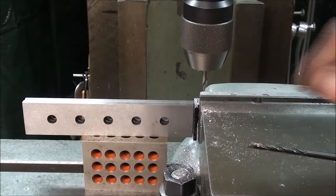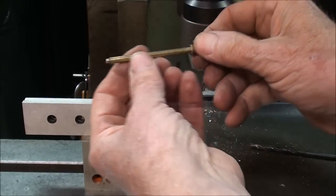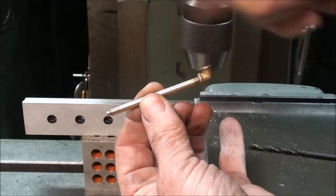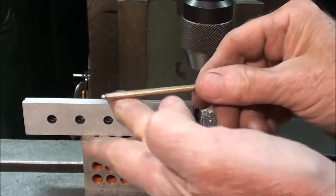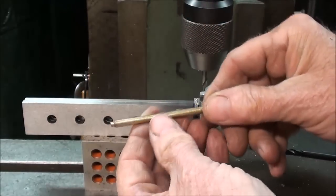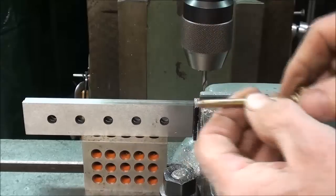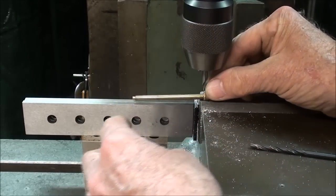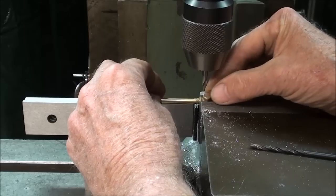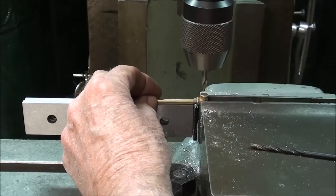I racked my brain for over 10 minutes trying to figure this out, but I've got the elbow in that mandrel again. If I can support this in a parallel position, then I'm assured that I've got a right angle here. I built this up with parallels — there's a 1-2-3 block and an inch-and-a-quarter parallels — and this seems to be holding at just the right height, so I can grip it there.